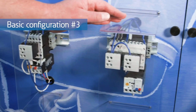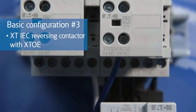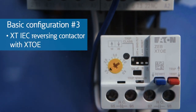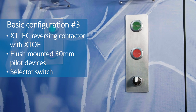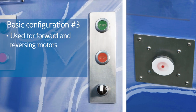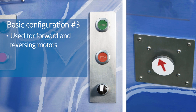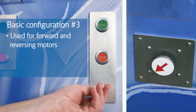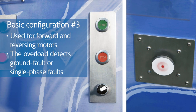The third configuration features an XT-IEC reversing contactor with an XT-OE solid-state electronic overload. We have flush-mounted 30mm pilot devices and a selector switch. These are used in an application that requires a motor to move both forward and in reverse — think of a garage door as an example. The electronic overload provides protection for your motor, and because it uses advanced sensors, it can detect additional faults such as single phase and ground fault, and can be remotely reset.